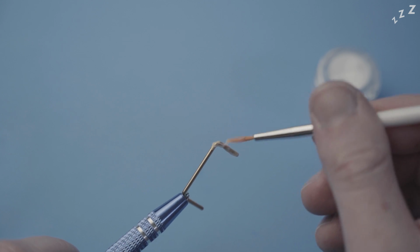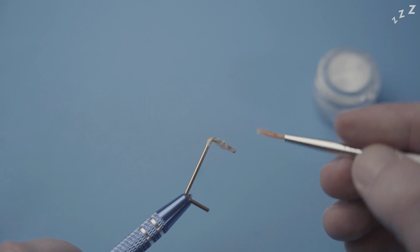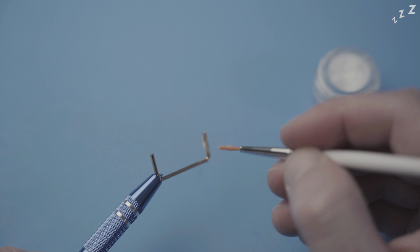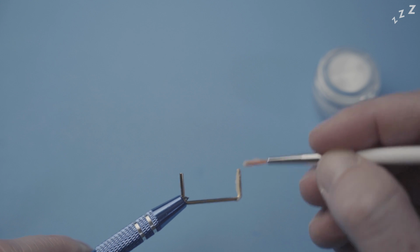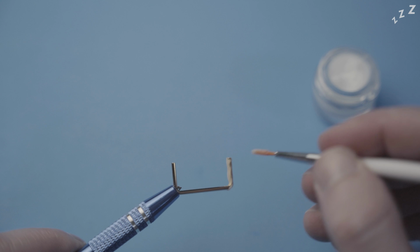And then go up past the bend of the wire where the stabilizer housing is going to make contact. And then the way that you'll know that you've lubricated the wires correctly is it should be an opaque coat. So once you're done, basically, you just won't see any of the wire underneath.